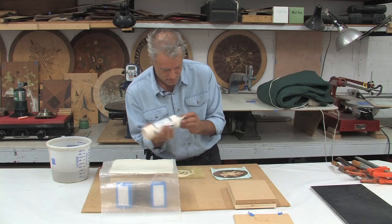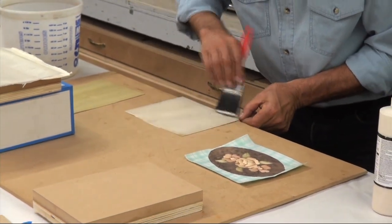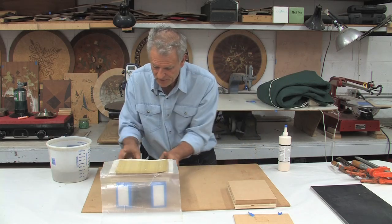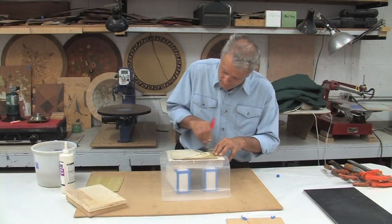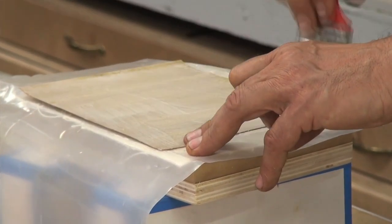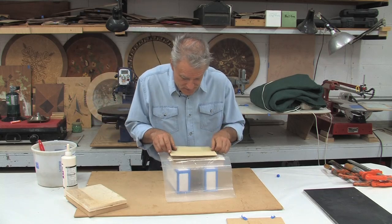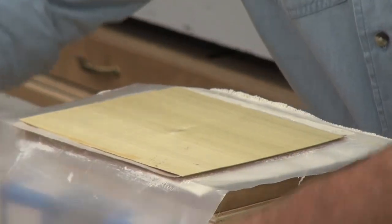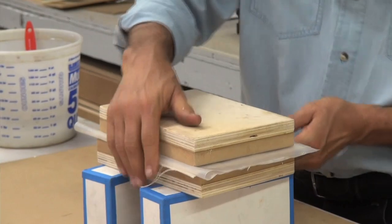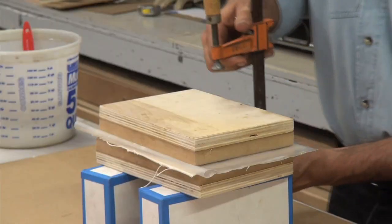That's about right. Lay this down on top. Sort of about as much glue as you would put on a wall that you wanted to cover with one coat of medium paint. Now I place it, making sure there's no debris. Wrap it with the plastic where I've put it into the bag. Top platen. And now it's time to start working it down. I think that it'll be enough to put four clamps on this.